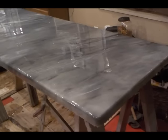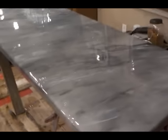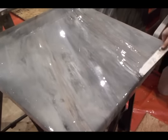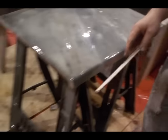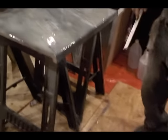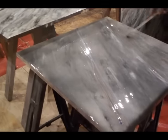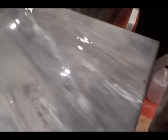If you're going to do this in your own kitchen it will go over Formica, but you'll need to use a bonding primer — I'll cover that in other videos. I do this off-site most of the time and then take it to the customer's home. Here's a little cobalt blue — this is metallic blue. I'll just put just a little bit of this through the top because I don't want a ton of blue showing, but it just gives it some interest.